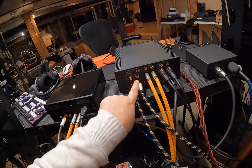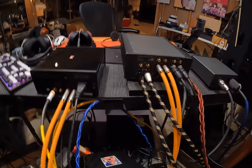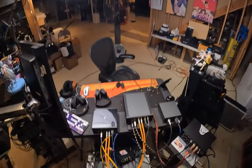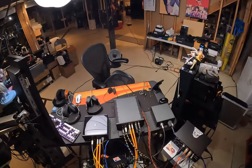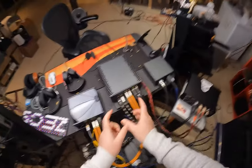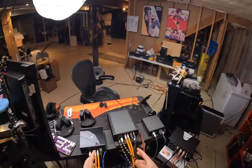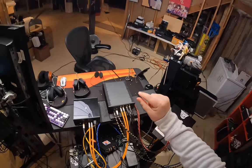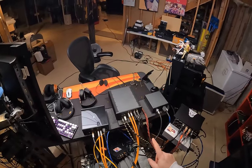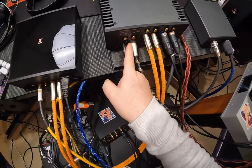And then you have a 0 or plus 15 decibel switch. I thought that was the high gain, and you could do high gain per input, but that's not it. I talked to Golden Sound because he's a patron of mine, and I'm a lover of his. And he's like, no, never, ever, unless you're using a phono output with zero volume, ever hit that switch. So it doesn't even have a gain switch. That's just to fix a broken input, essentially.